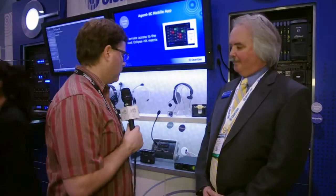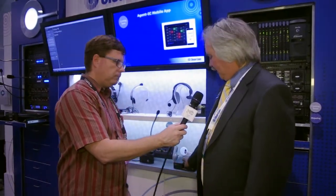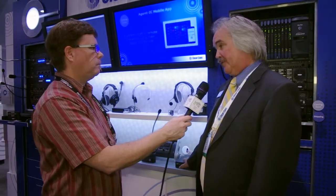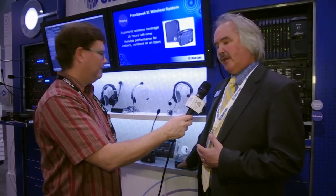Really across the country. So let's talk about LQ. What we've got is a product called LQ. It's a two-channel, either two-wire or four-wire device. It can be ClearCom or RTS, so we can literally go into a facility that isn't all ClearCom and convert to use it that way. This connects over IP, and unlike some other boxes, this works over WAN, LAN, or the public internet — so it doesn't have to be on the same subnet. It can be literally anywhere in the world.